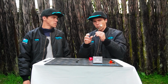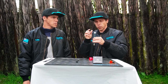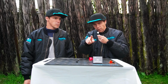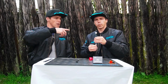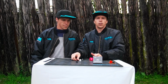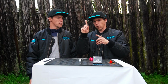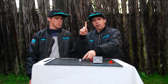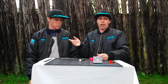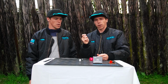So omnidirectional, outwards. This is right hand circular polarized, so it will be going like this. The right hand, like a big mushroom. Left hand, yes. That's the signal going outwards. There's also linear, that's the third one. Let's just say that this didn't have this on the top, and it was just bidirectional. It'll be just like a pin like that. And that's the other version that goes around like that. But the linear waves will be going this way, whereas these ones go mushroom shaped and elliptic.